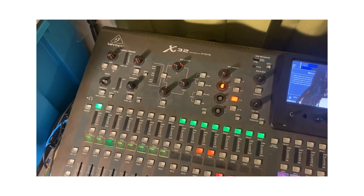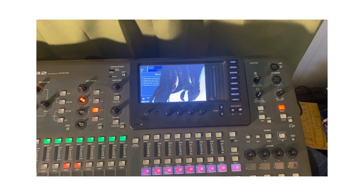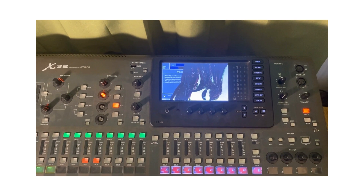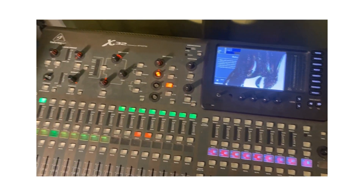This is the M32 SD card inside there. When the screen boots, you're going to see the M32 logo. All you need to do is swap out the M32 SD card for an X32 SD card. Just to recap: the MCU for the M32 can be used in the X32 — all you need to do is swap out the SD cards. I have cloned SD cards for both the M32 and the X32, so if you'd like one, just reach out to me via email.